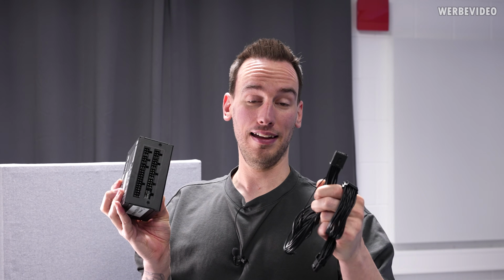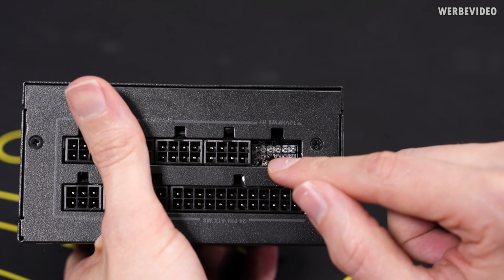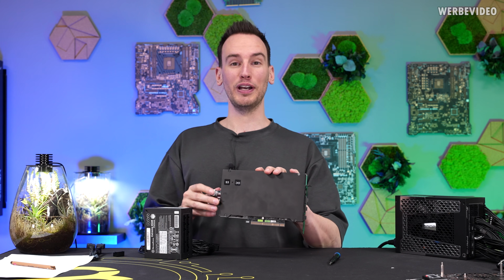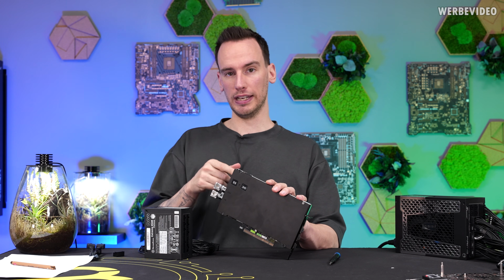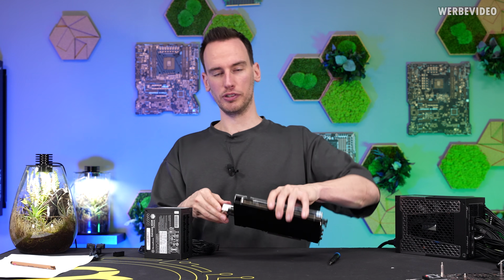Oh, well, I somehow disassembled the connector out of the PSU, but this is still sitting firmly together. At least on the PSU side, we can also see that this pin is a bit darker, the same one that we found looking strange before. At least we finally achieved what we wanted. We could get the cable out, which means I can take the card apart and then we can remove the old connector and just replace it with a new one, basically doing the GPU vendor's work.